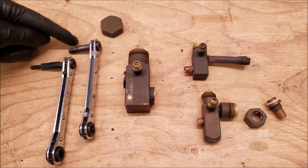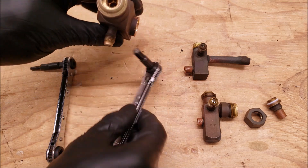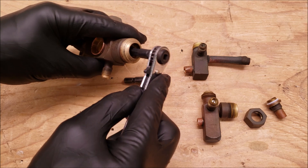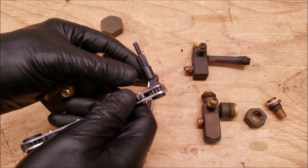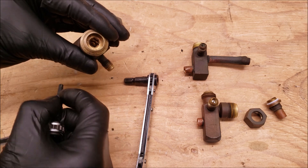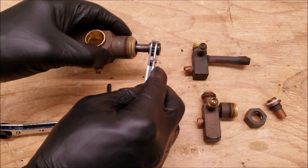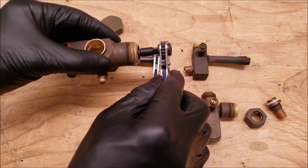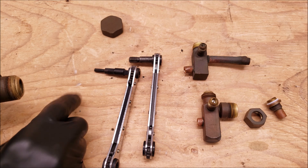I have two hex keys that I keep in the truck. I actually cut off the front part of one because manufacturers are not making the inner chamber on the stem as deep as they used to. This used to fit all the way down inside the valve, but lately on a lot of service valves they're making it shallower and shallower, so you're only getting this much into here — and what happens is it ends up stripping it. So I cut the tip off and I use this one often just for the vapor line service valves because it falls all the way down inside. On some of the newer ones it doesn't even go in that far. That's why I have two hex keys on my ratcheting service wrenches.